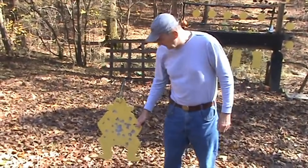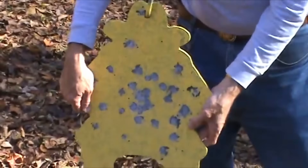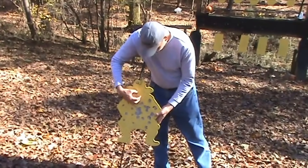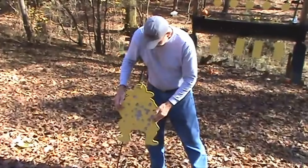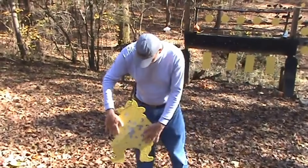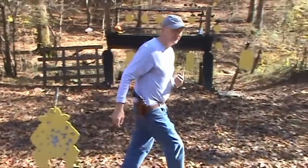If your targets are hardened steel — this thing is armor plate, it's hard — it's been shot a lot. I've had this six or seven, eight years, and there's not even a dimple in it except the paint. The paint's been repainted and knocked off, but that thing is hard. When the lead hits it, it just goes down to the ground. So it's important to have hard steel, perfectly flat, and not have edges on your targets. We'll talk more about that as we move on through.